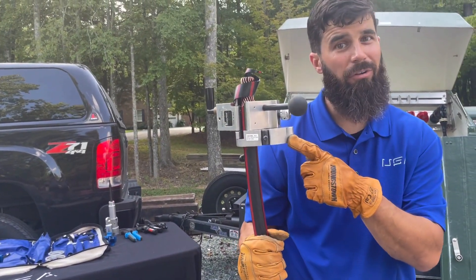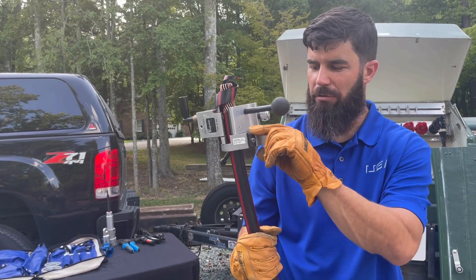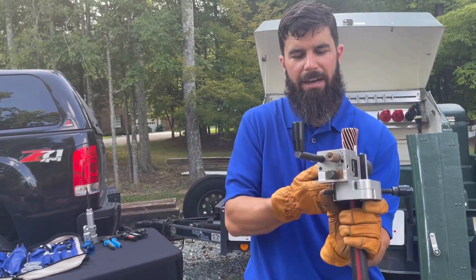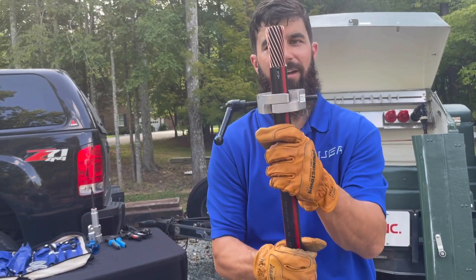You've noticed here I put this clamp on here, also from Ripley. This is the QC2. This is a clamp that's universal — it's meant to set at whatever depth you need. Once the tool bottoms out on it, it gives you a nice, round, 90-degree cut right there, so I can peel it off nice and sharp.